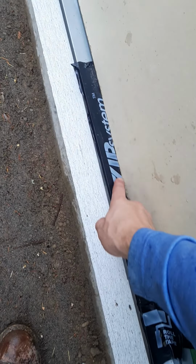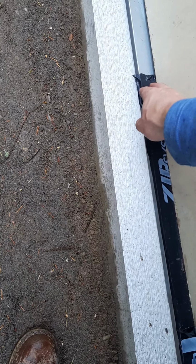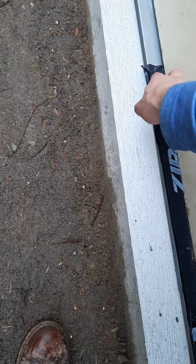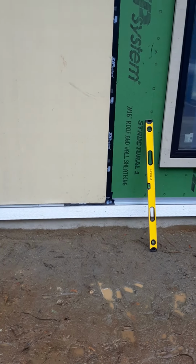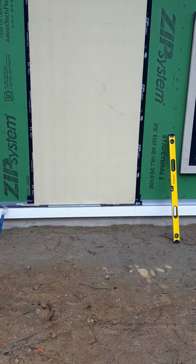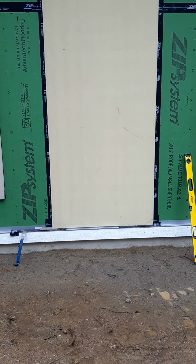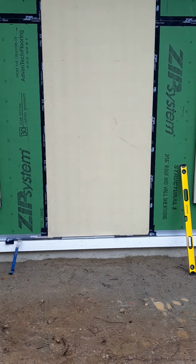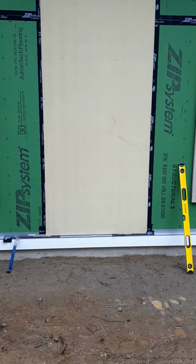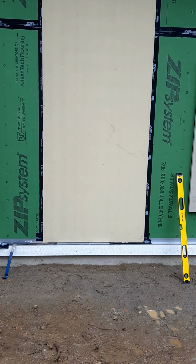And then what I do to hold them in place, I guess first of all, I put them on, I made a 1/4 inch. Hardie wants you to have a 1/4 inch gap below them, so I made strips that are 1/4 inch thick. I think this is like MDF, so I had to wrap it in plastic. I tried to cut 1/4 inch strips of little pieces of 2x4, and they ended up breaking. And the bottom of these things, they're really fragile. So if you don't have a big enough little shim under there, it'll start to fray at the bottom and crack, and that's what happened to me. So I made these, I put them under there. These are working a lot better than the other shims I was using.